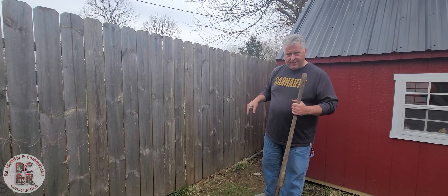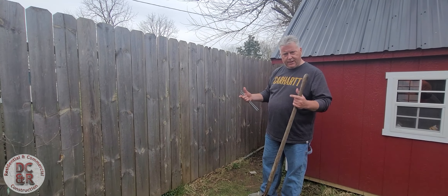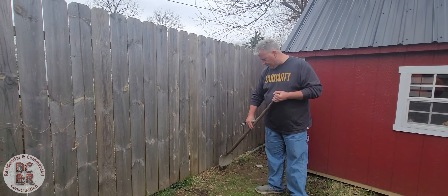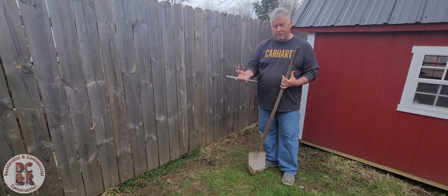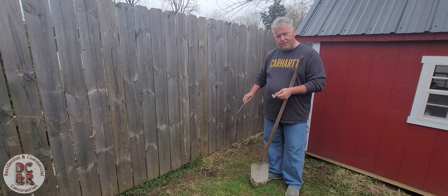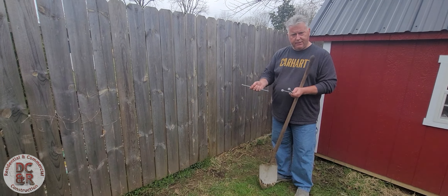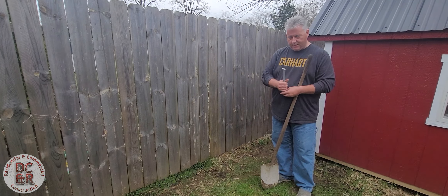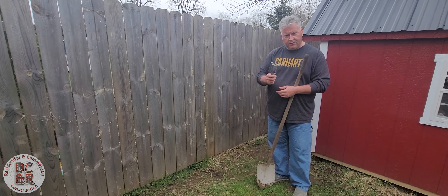In order to fix this, I don't want to take the whole fence down because we have dogs and neighbors and things. So what I want to do is dig around this hole and expose that foam. I was looking for some rebar, couldn't find any, so in my shop I had some carriage bolts. What I'm going to do is insert these bolts in different locations in that foam, and we're going to fill this with concrete that's going to go around these bolts and give it a whole lot of extra strength.